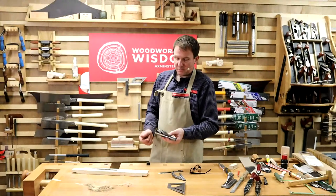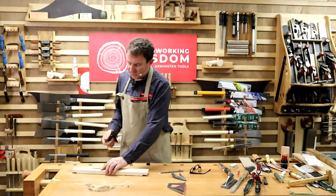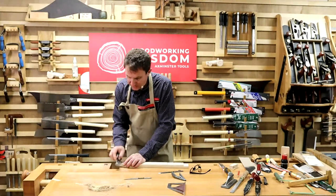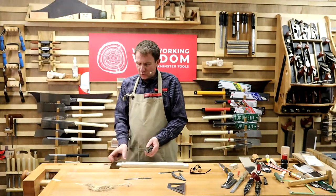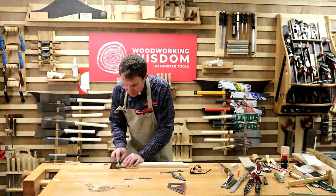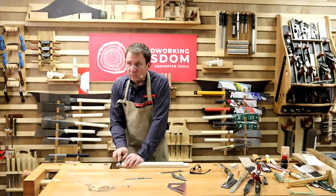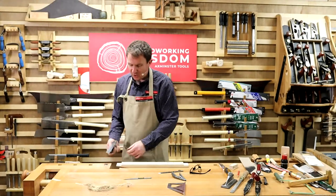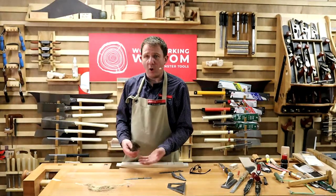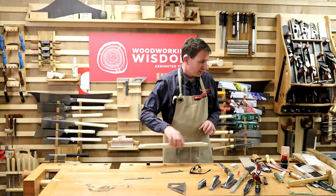In fact, the more I play with them, the more I can get right into things like your tenons and stuff, into that recess. Not difficult. If you think about trying to hold a cork sanding block where we are now, you've got to grip the top of it, trying to get into that corner. You might not want to sand the side face, just the bottom. Easy to do, okay? And you might want to take a little bit off. It also gives you a finished surface, something clean that you can put your polish straight on top of, okay? So, great to use.